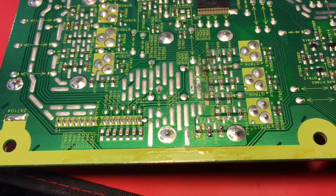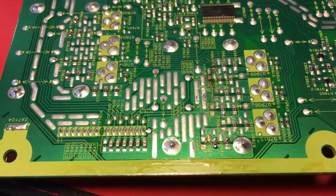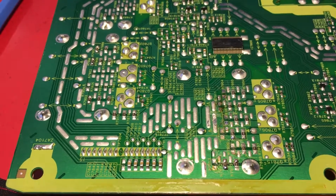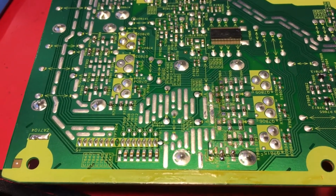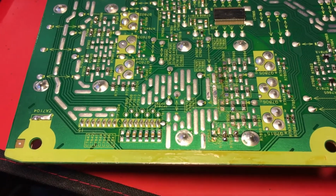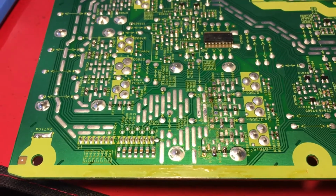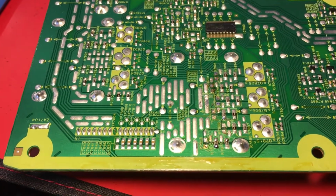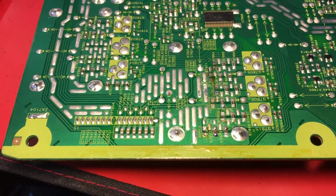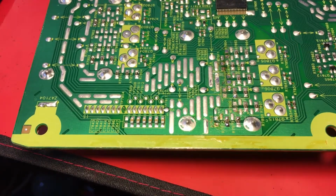It's not going to do any damage to the TV, so you can safely do that if you really know what you're doing and modify the backlight circuit. Although the picture will be slightly darker and the backlight less intense, the customer is not going to notice any difference. You can set the backlight to maximum. As I said before, even if you just replace one LED, it doesn't make a difference. It's still going to be much better for the circuit. So it will just make it more reliable, and the backlights will last longer for you.